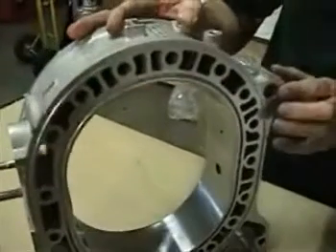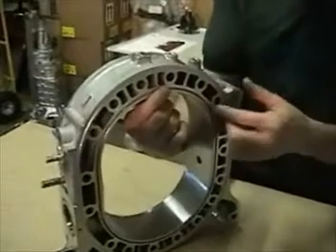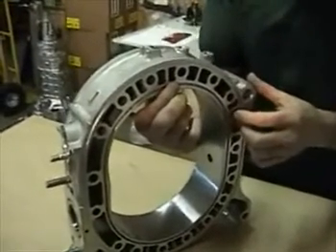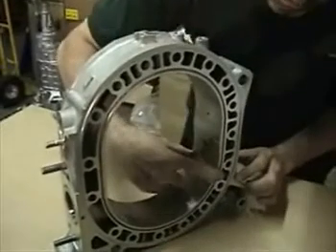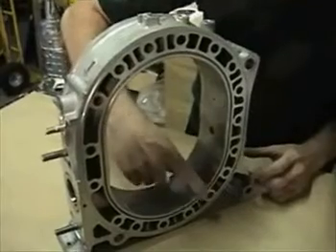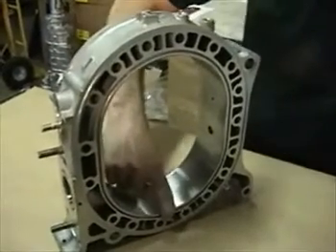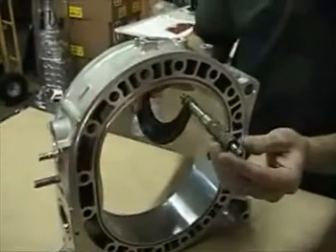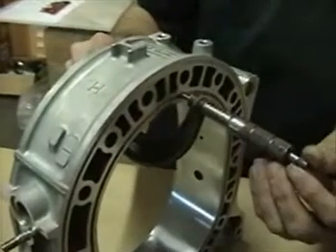For shrinkage, we are going to take measurements of the width of the housing — usually four to six spots. The top is your coldest area, so we're going to use that as our zero measurement. Then we'll take readings down from about an inch below the lead spark plug hole and about every three-quarters of an inch down to about the base. You'll be able to tell when you're done because the reading will typically go from your zero measurement, increasingly get worse, and then the shrinkage will get better.